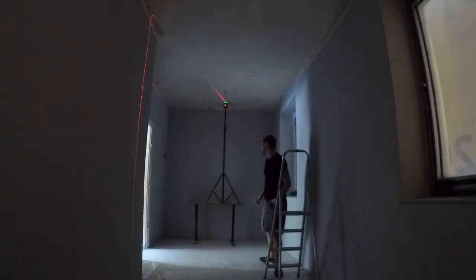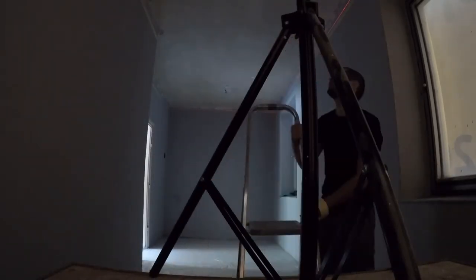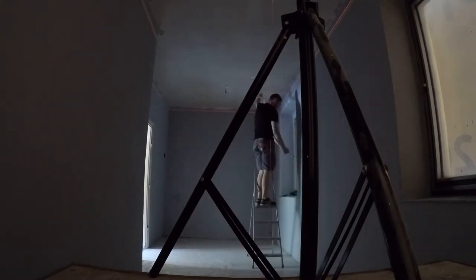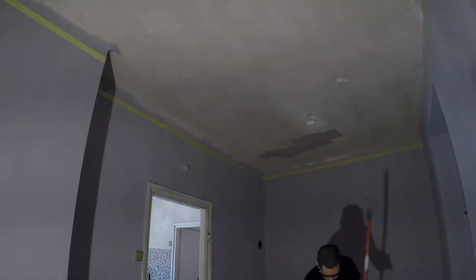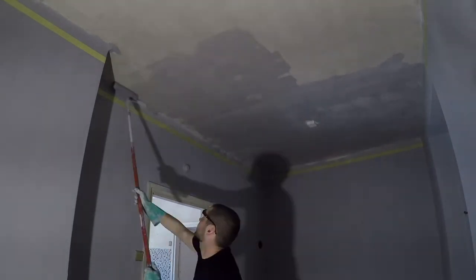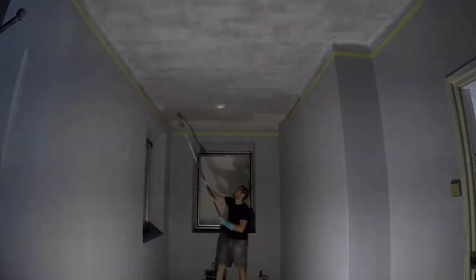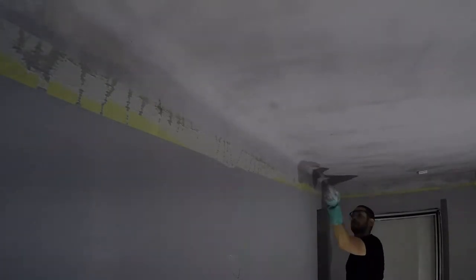The ceiling will be in a much lighter shade of grey, and I want to make the transition sharp, so I will use masking tape to divide the surfaces. I'm using a laser level to have the transition at the same height around the shop, and I learned that neither the floor nor the ceiling are level — the ceiling goes up towards the window and the floor goes down towards the window. One side note: it is better to do the ceiling first and the walls later, because the law of gravity is merciless and the ceiling paint really likes to drip down onto the walls.